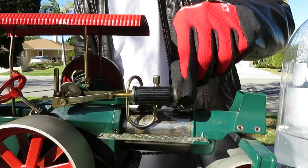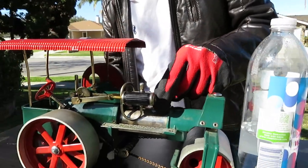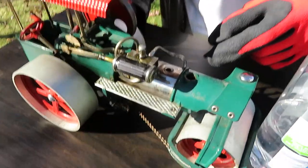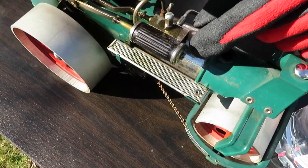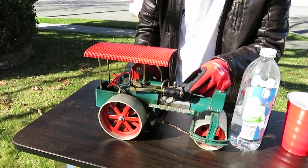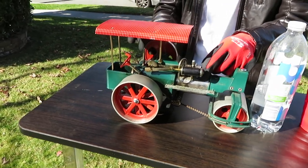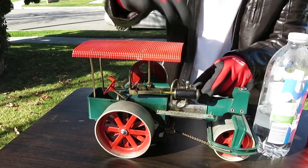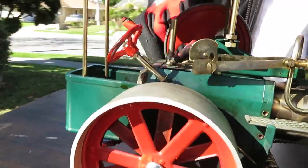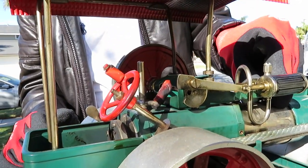Right now we're checking the safety valve to make sure it's on correctly. I'm going to unscrew this all the way and check to see if there's water in the boiler — which there is, unfortunately the lighting won't let you see it. We're going to screw that back on carefully. We also have to check that all our points are oiled correctly. I oiled this steamroller earlier so it should be fine. Here we have our cylinder automatic lubricator, and we also have our flywheel — making sure that is moving without any obstruction.